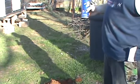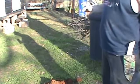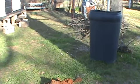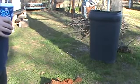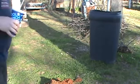With this well, if I get good water, I will go out and get some cement blocks and concrete, put a concrete floor, put concrete around the well stem, and then put a well house over this one so nothing can get in, unless it's going into the ground underneath, and I doubt it, not that far down, because it's purified by natural earth purification when it's down 25 feet or farther. If you get down in the ground 15, 20 feet even, it's purified. The water has gone through the natural process of the earth, and it should be clean water. Should be. Provided that gas or oil or something else hasn't got in, or mercury. There's a whole lot of things that I'll have to test for before drinking the well water.